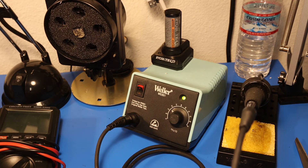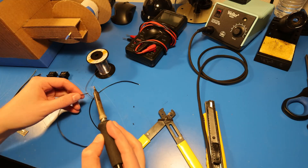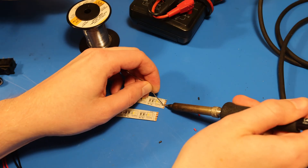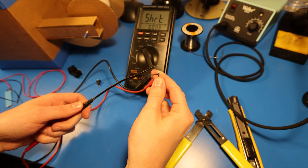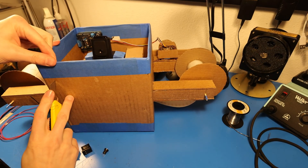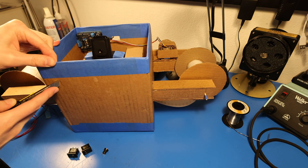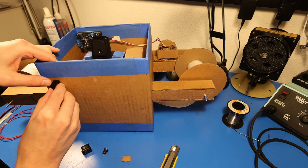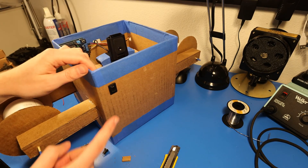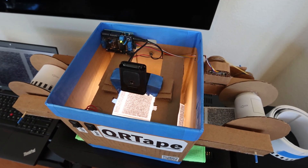With the software figured out, I turned my attention back to the hardware. I decided to polish this up a bit and add some LEDs and power switches for the light and motor. In the interest of time, I won't take you through the finer details of the wiring, but the end result is simple: two switches — one to enable 6 LEDs to illuminate the platform, and another to enable the stepper motor. Up until this point, I was using a flashlight to illuminate the QR codes. This was actually too bright and was washing out the image slightly, so the LEDs actually helped with scanning performance. I was also turning the spools manually to get the QR codes to scan. Adding a stepper motor makes it feel a lot more like a reel-to-reel tape recorder from decades past.